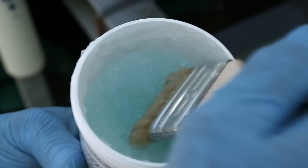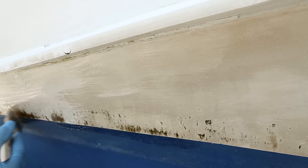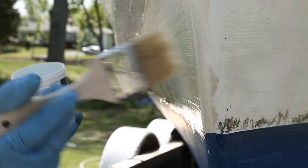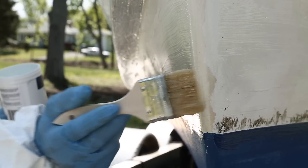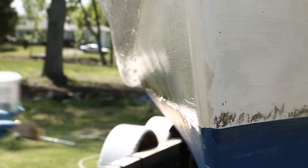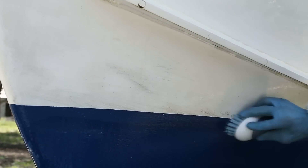After the topsides are all taken care of, we'll tape off the topside when we paint the bottom. We want to make sure we get it everywhere, so I'm going to look up at the bottom of the spray rail and make sure I've applied it to the entire bottom of that spray rail. We'll let it sit for 10 or 15 minutes before rinsing, and you want to keep the entire boat wet because you don't want this product to dry on the hull in sunlight — that would make it harder to take off.